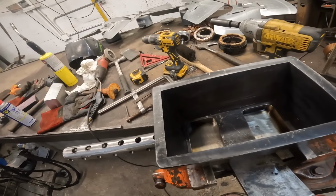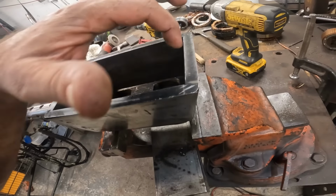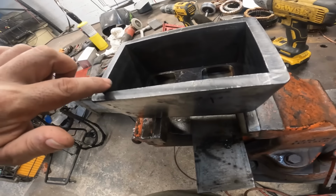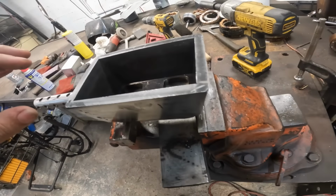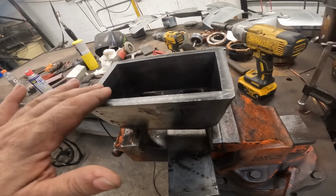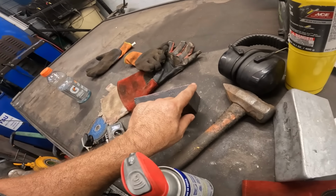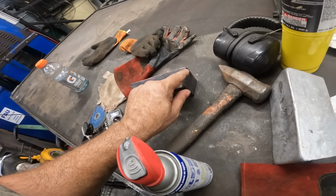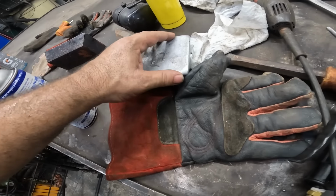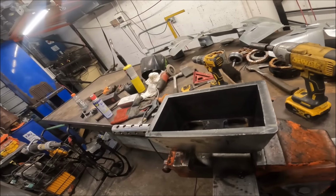And then definitely what we're gonna do is mill half of this down, probably about 1/4 inch, so that there is a lip out here that protects that edge. And then we can almost over pour it just a little bit. I don't know, we'll see how it comes out. We want to get it, because this thing shrunk, all these things shrink. Okay, I need that edge. See, I'm gonna have to cut that down to here. This one here, I'm gonna have to cut down to here, so we're losing a lot. So I actually need to over pour on these edges so that it doesn't shrink. We're gonna figure it out.